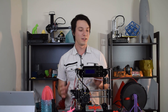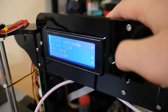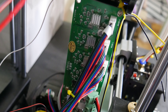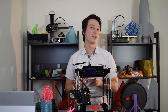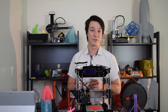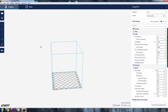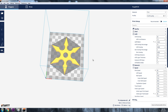Let's talk about user experience with the Start. Similar to the Tronxy X1, you have a fairly janky tactile switch interface which works okay, but I'd much rather an encoder wheel interface — it just seems to work a lot more fluidly. The machine has an all-in-one Melzi-style control board, which you load G-code onto via the micro-SD card. It's a bit of a pain to access at the back, but not the worst I've seen. You could also run this printer via the USB port using OctoPrint or tethered to a PC, but I've personally always preferred SD cards. To make things easier, iMaker and MyMiniFactory have skinned their own version of Cura with presets and a convenient MyMiniFactory browser, so you can download files straight into the slicer. This works nicely and it's a pretty good trick to train people into using just one ecosystem.